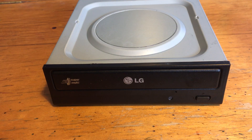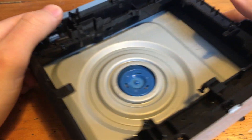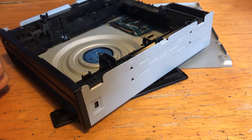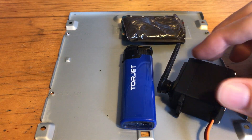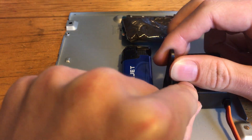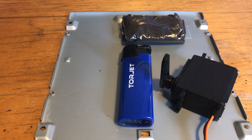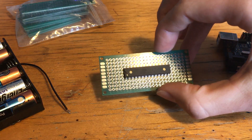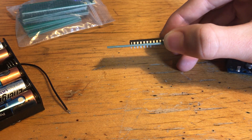Since this is going to be taking up a decent amount of space inside a computer, I'm going to be hiding it inside an optical drive that I've hollowed out. Optical drives and SSDs use exactly the same connectors — one for power, one for data — so it shouldn't be obvious there's an SSD inside. When the self-destruct sequence is initiated, a servo will turn, pulling on a piece of string hot-glued to the button of a jet lighter, igniting the thermite and wrecking the SSD. All this will be controlled by a barebones Arduino — an ATmega328P chip soldered onto a circuit board — which is more compact and consumes a lot less battery power than a full Arduino Uno.